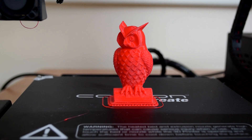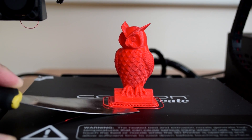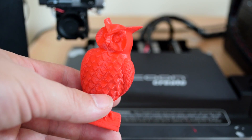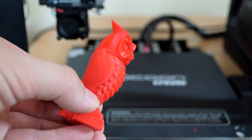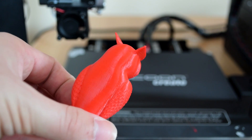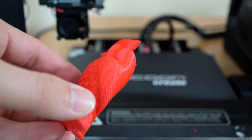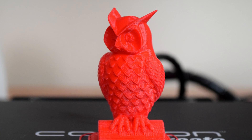I didn't want to discount the filament too quickly, so I went to printing a small, high-detail print — the classic owl from Thingiverse. I'll put the link in the description. I printed it at 100 micron layer height and bumped the temperature up to 215 degrees Celsius, and that really seemed to make a massive difference in terms of print quality. This is just phenomenal. There are a few deviations, but it's definitely the printer doing it — a few wavy imperfections — not the filament.